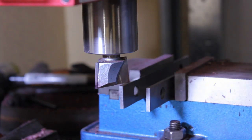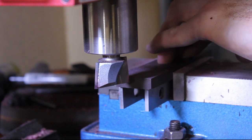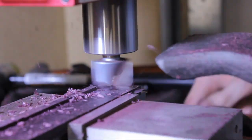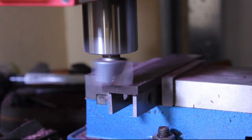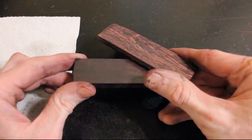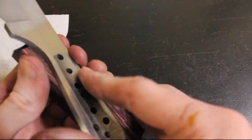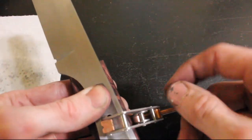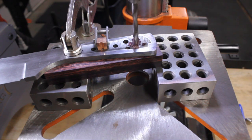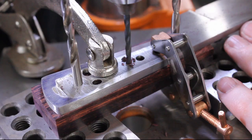After I have it set up, I can just take one piece out, put the other piece in, and I'll have two slabs that are the same thickness and relatively flat. Next I clamped them onto the knife with a cant twist clamp, then used the knife as a drill guide to drill those number 12 holes and eventually the number 30 hole in the middle.